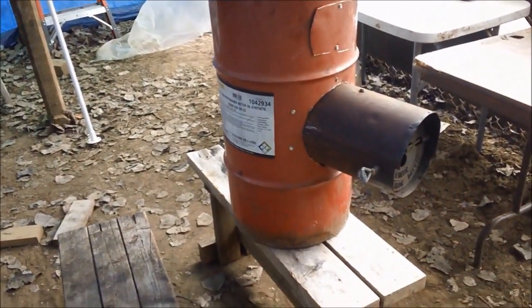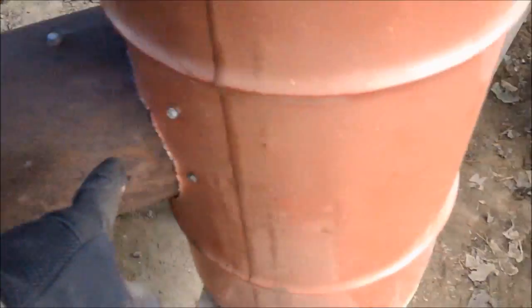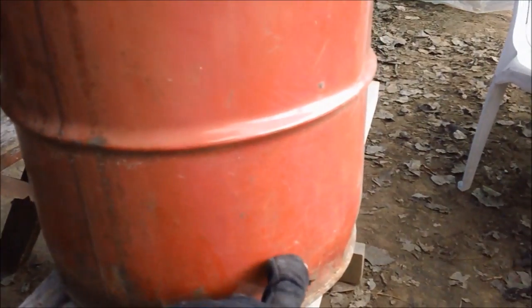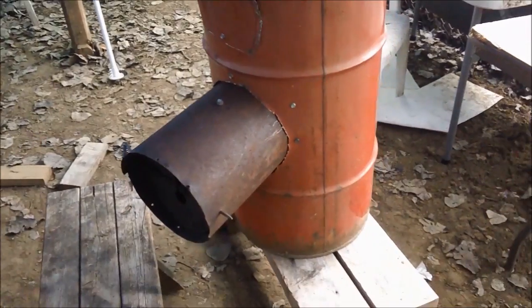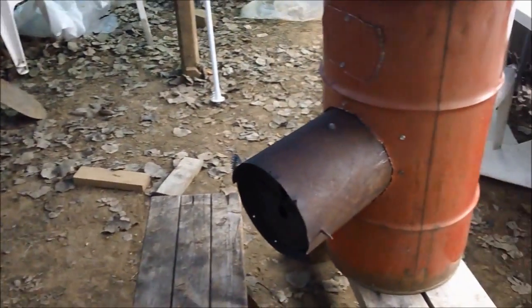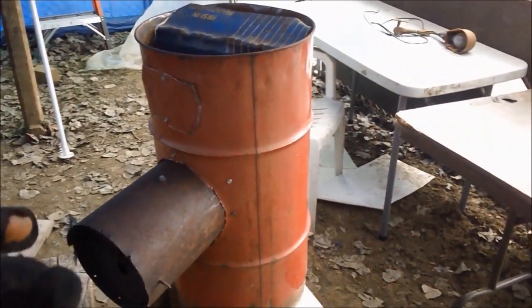There it is, standing up on its end. There's the flue end that goes into the wood burner, and we have our exit port right there - this is technically the back side of the exchanger. Smoke is going to come in here, go down the chamber, over, then back up and out that hole. There's our baffle - the first baffle is actually part of the pipe. The smoke comes up, hits the baffle, and there's another lip on the baffle plate up there too, so it hits that plate, comes around this side, and out our hole. This ought to re-burn some of the gas and collect a lot more heat, since that cast iron stove takes an hour or two just to warm up. This should get direct fire and direct heat straight out of the stove, so you should feel immediate heat right away.